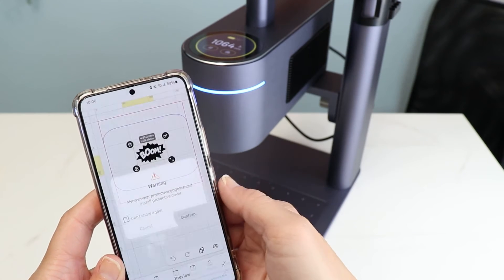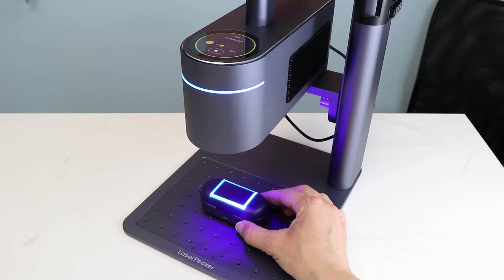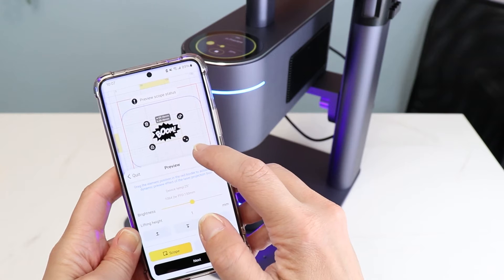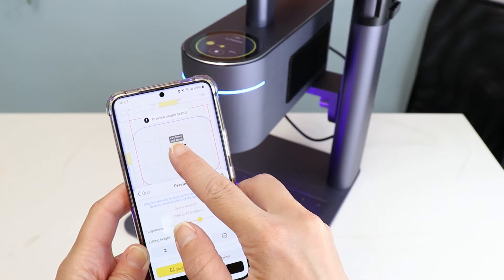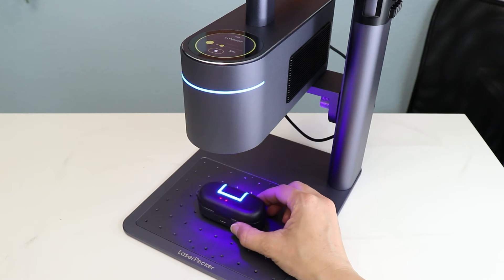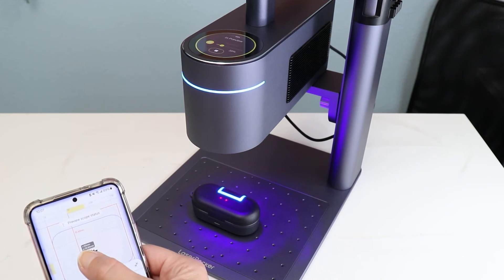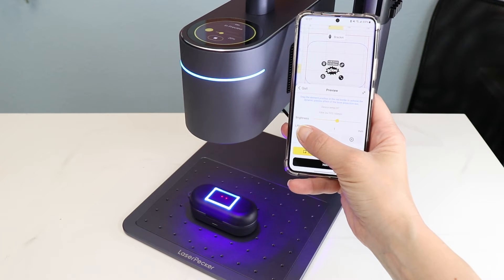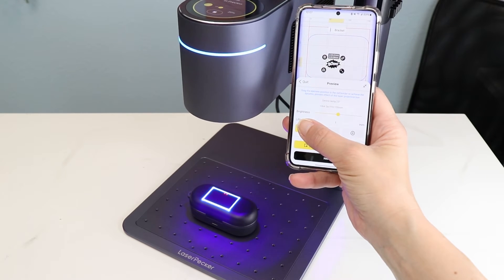Start by downloading the app and connecting your machine via Bluetooth. I'm going to use some of the clip art that's built in to engrave an earbud case. I can pick the design I want and then size it appropriately, then hit preview. This is going to show you where to place the design on your piece. Now I don't have the shield up, so I am wearing goggles. I want to place the box exactly where my graphic is going to be. It's easy to slide the design around and scale it up or down. You'll notice these two red dots — this is the focus. The laser needs to be in focus in order for it to work, so I can move my laser head up or down in the app or manually until those two dots become one, which means my design is focused.